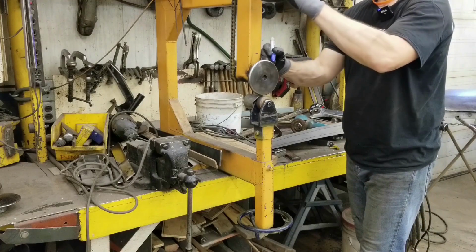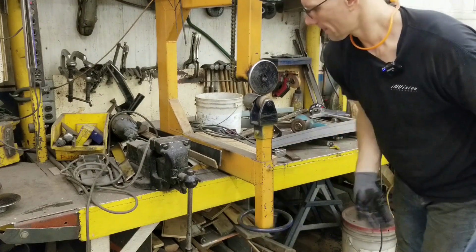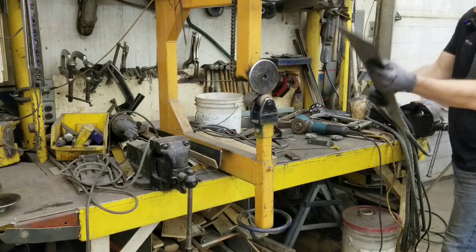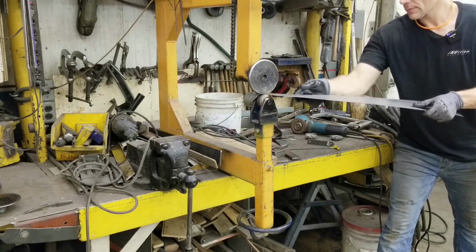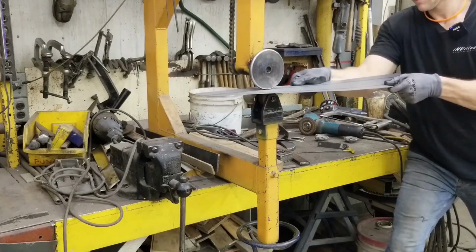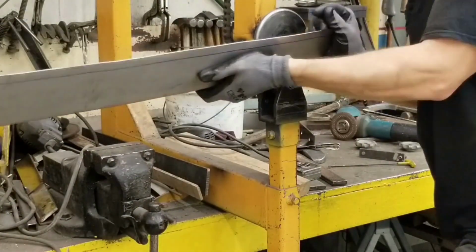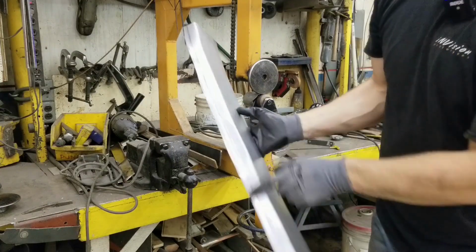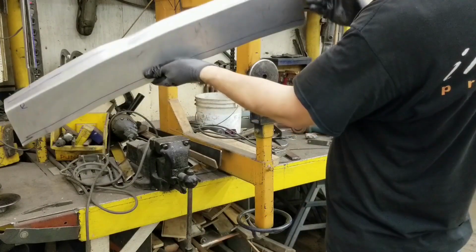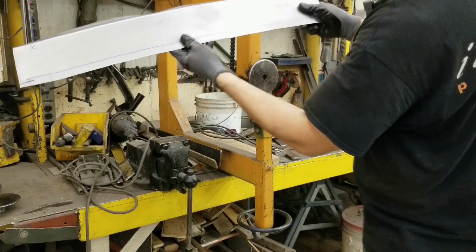So again, we're using the soft radius upper wheel. So you can see we got this wavy edge. We're gonna have to shrink that a little bit and then roll over the next leg. That's the back and that's the front. It's gonna sit just like that. This here leg has to be rolled in and then rolled back out.